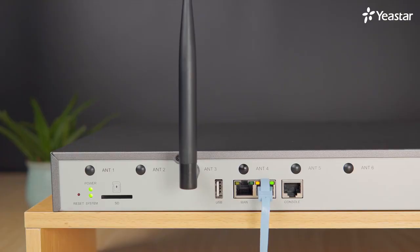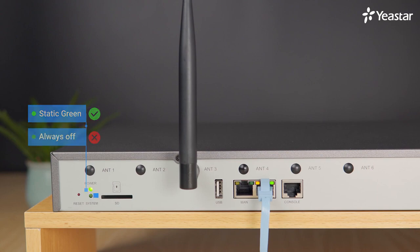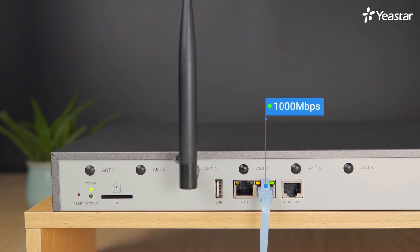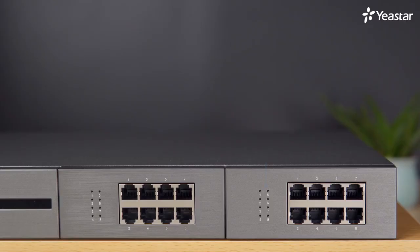Back to the PBX. We can check the status of the LED indicators on the back panel to see whether the equipment is running normally. The power LED indicator is static green; if the light is off, it means the equipment isn't running at all. The system LED indicator: if it's blinking in green, the system works correctly; if it's static green or turns off, there must be something wrong with the system. The LED indicators of the WAN port and LAN port are usually off. If connected to a network at 1000 Mbps, the light will turn static green. If connected at 10 to 100 Mbps, the light will turn static orange. We can also check whether modules installed are running normally by checking the LED indicators on the front panel.